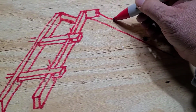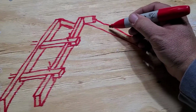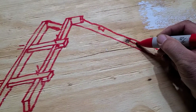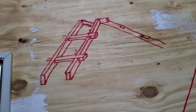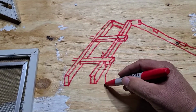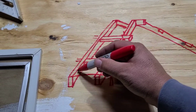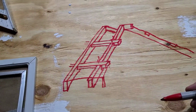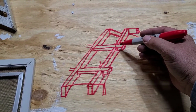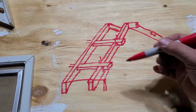Obviously, this is the top of that gable truss coming down there with more outrigger cuts on the other side. Just like that. And then the tail of your fascia board just kind of hangs out here, and it's held up by whatever kind of sheeting or purlin you put across these other two. But remember to keep these on 2-foot centers. So if you've got plywood that's 4 foot, you've got a place to screw it at 2 foot, and then it splices at 4 foot.